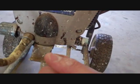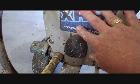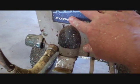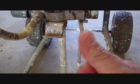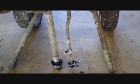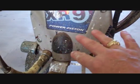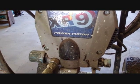The hose does have water in it. When I sprayed water through it to clean it out, the hose is still full of water. So this would be full of water too, and you don't want that, especially if you live in a cold climate. So I charge it with antifreeze. Antifreeze has a lubricating property to it. I just got some off the floor there, and it's kind of slick, and it lubricates all your internal pistons and stuff like that. So anyway, that's what they recommend.